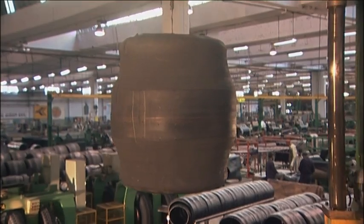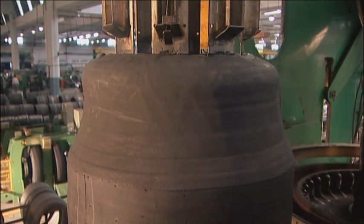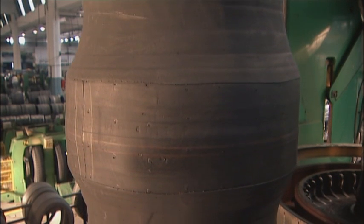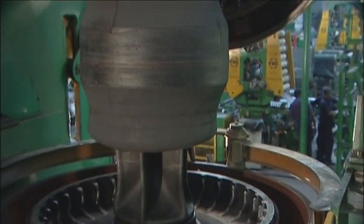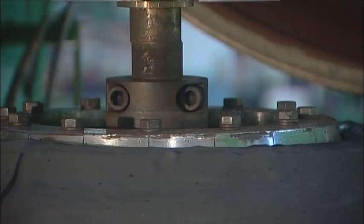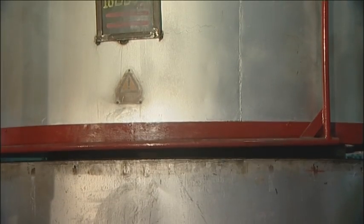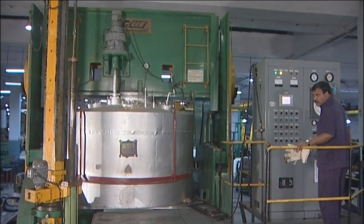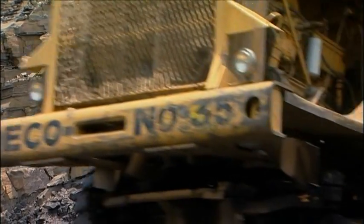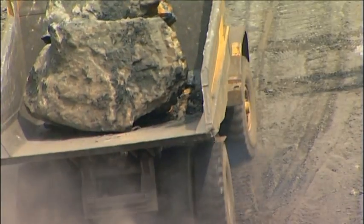The green tyre comes to the mammoth curing press. The process of vulcanizing the green tyre by subjecting it to heat is called curing by the tyre industry. Hot water and high pressure steam is pumped inside the bladder. The external portion of the tyre is cured by low pressure dome steam. Inside this huge machine, the green tyre takes the pattern of the mould. JK Tyre's OTR products offer customers maximum flexibility because of the non-directional tread design with patterns optimized for added safety and extra pulling power.